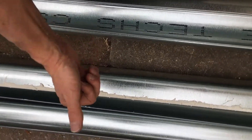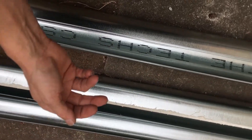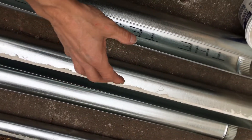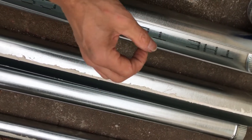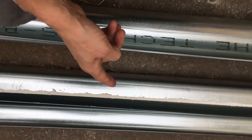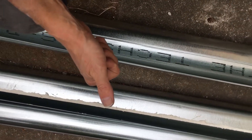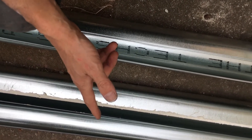We're going to use a manometer and actually measure the back pressure on the system, because on this particular manufacturer's unit they recommend not having any more than 0.83 inches of water column as back pressure caused by your ducting. You have to keep the airflow up. You never downsize your ducting, because you get massive back pressure, higher energy bills, and longer drying times.